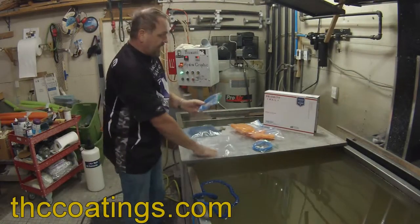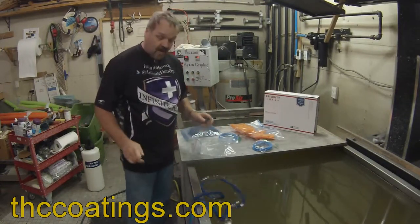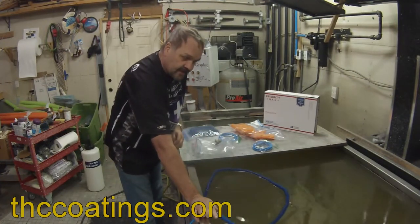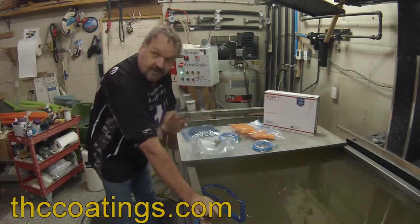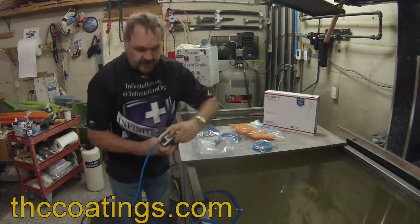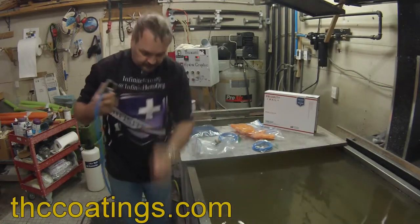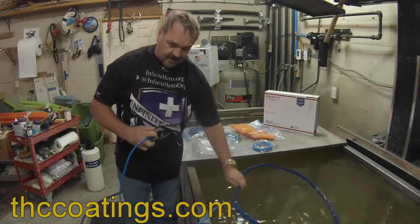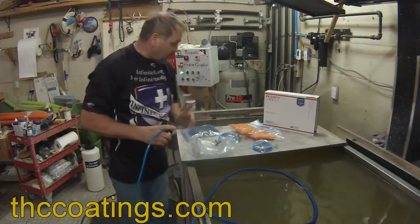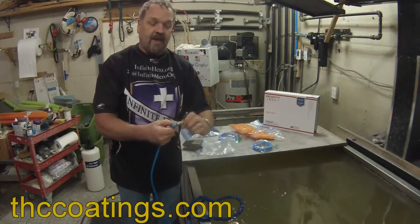You are going to get another 48-inch hose in your kit, and the reason for that is sometimes guys have a really hard time — some objects just work better when, after you release, it comes in kind of quick on you. I found two different ways to handle that: restrict the air exhaust on the foot pedal. This is your exhaust hose right here — if you're able to restrict this hose, you're able to let the air out a little bit slower.